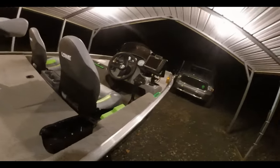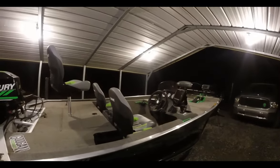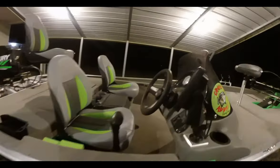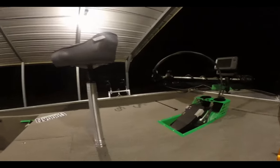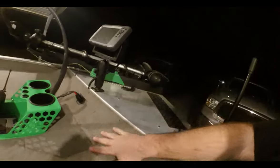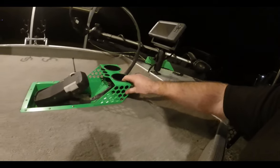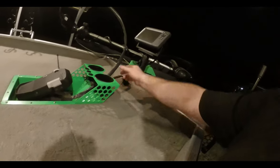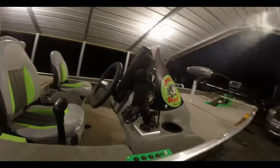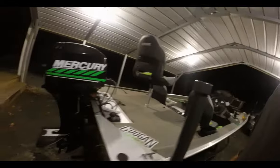It's gotten dark — almost 10 o'clock at night. I finally finished today, working on it off and on. My GoPro died so I didn't film the final install, but I did get the LED interior lights run under the edge of the gunnel with wires tucked under the kick plate. I got the exterior lights run, drilled a hole, caulked it, and filled it with marine grade silicone. Now for the exciting part — let me show you what it looks like.